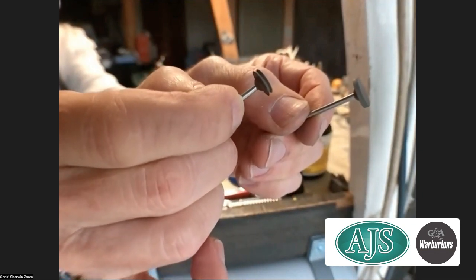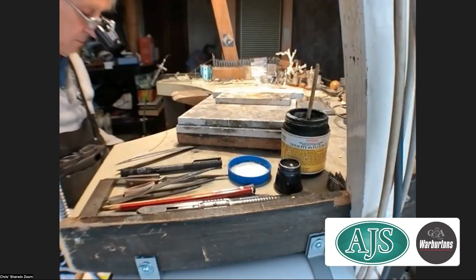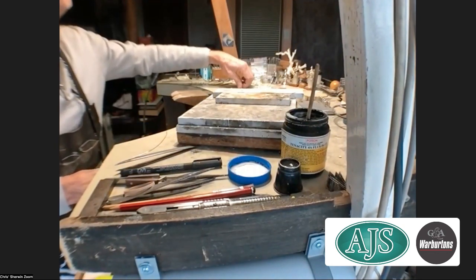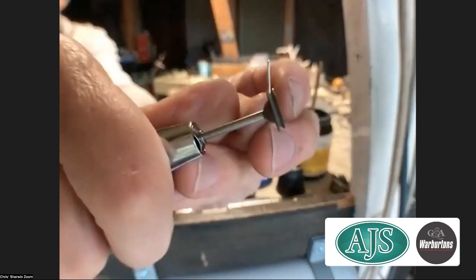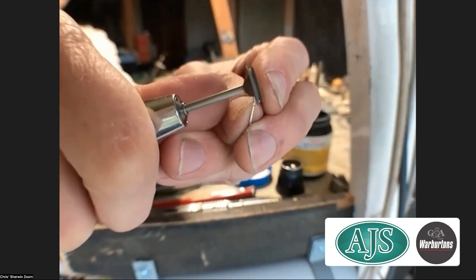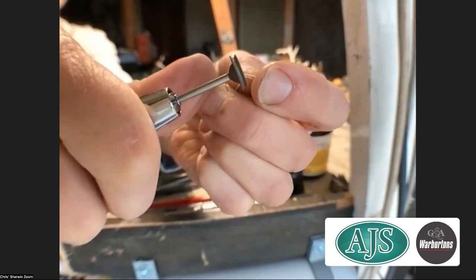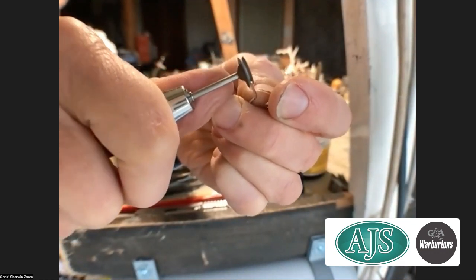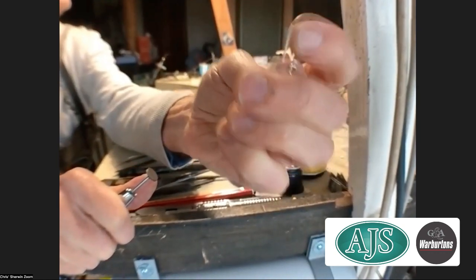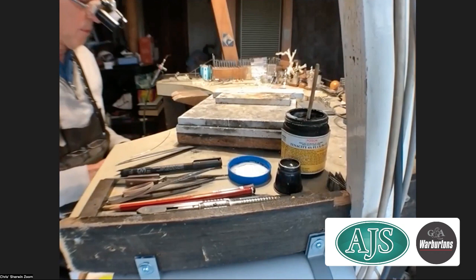See it against my finger. Nice little groove. Very easy to put in with the scribe. And they just roll up over the wire. I'll show you that on camera. That's a great little trick there, Chris. These are great little tips. You can just put your wire in, and that will follow the shape of the wire. I'm on a difficult angle here. Turn it around. Do the same on that side. And it rolls over the wire, and you get a really nicely polished wire in the end. Nice, soft finish on your wire, after you've scratched it up using your escapement file.